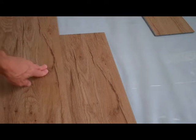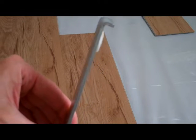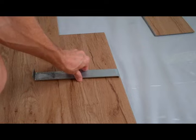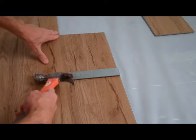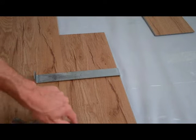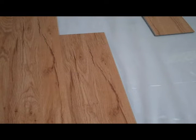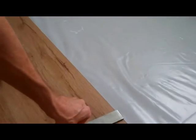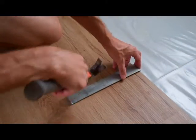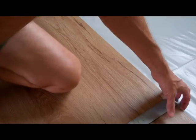For any residual gap, I come back with this specialized tapping tool — you'll need to pick one up. I couldn't have done this job without a tool like this. You put it in and give it a little tap, but you only need to tap if you see a little bit of a gap. If there's no gap, it's in well. Some people want to whack it — you don't want to whack it. You just want to tap.